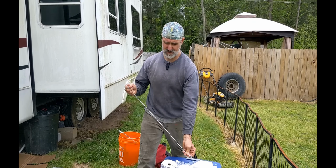And now, just because I'm a bit of a perfectionist, I'm going to use a file and I'm going to straighten everything out, and if it's not dead square, it probably doesn't have to be dead square, but it's at least going to look like it has a perfectly square cut and a finished edge. This cut here is pretty poor. You can see why I want to file some of that smooth, but in 3 minutes of filing, I'll have it all perfectly straight and square.